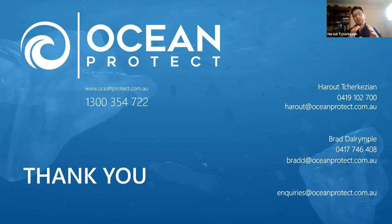So even if that bottom, say 100 mil, is not part of the area under the hood where the agitation occurs with that backflush mechanism, you're still giving it a bit of a chance to clear because the water's got to come back down through that pathway anyway via the cartridge. But in simple terms, as I said, Laith, we're going out to a lot of these sites, and happy to go out with you guys from council as well if you want to go and inspect a few systems.